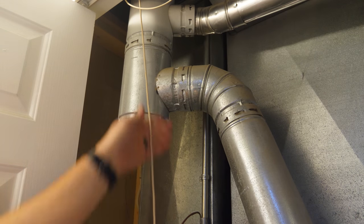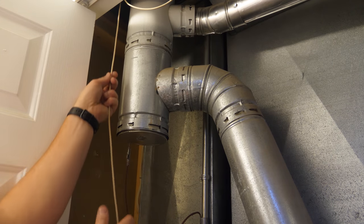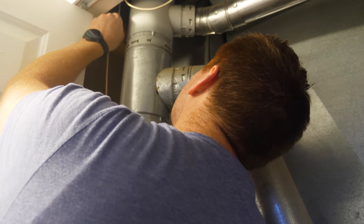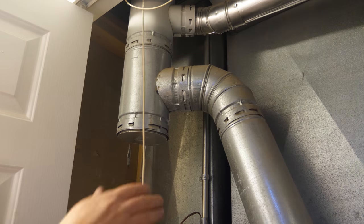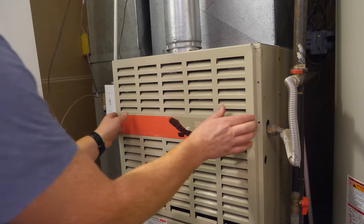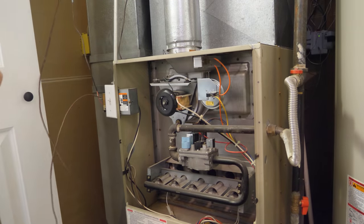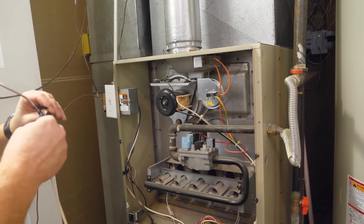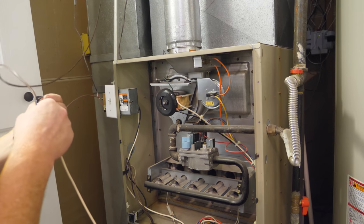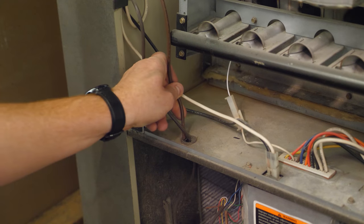Going down into my furnace here, I can see the one wire and again it had been spliced on the other end, but now I know exactly where this wire goes. I started pulling it lightly. On the other end my wife helped feed the wire through — it got caught a tiny bit at the electrical tape but after a little force it came right through, so now I have a wire running from my thermostat to my furnace. With the furnace off, pull off the covers and pay attention to the previous routing of the thermostat wire.